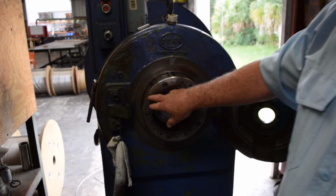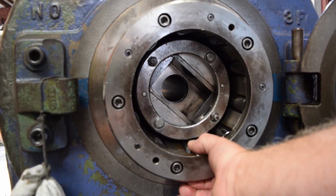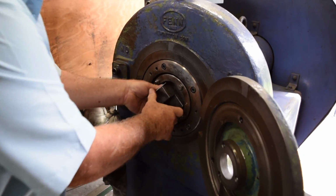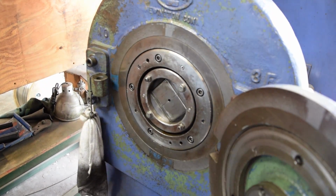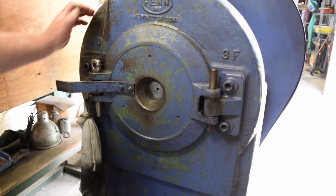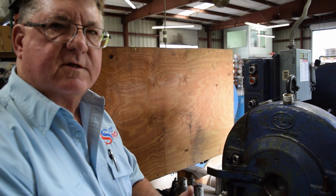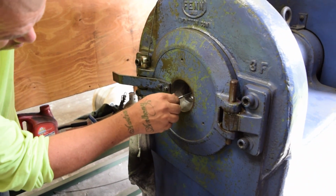They showed me some of their many swagers, and I got to see a rotary swage in process. And that clapping noise you're hearing is nothing but the cams rolling across the rollers, driving the dies into a specific shape, and it rolls around the fitting.